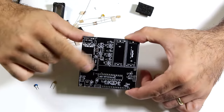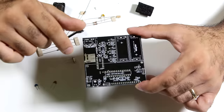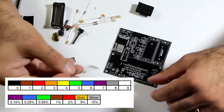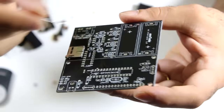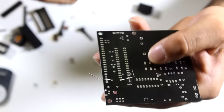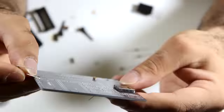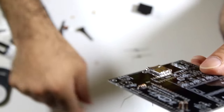Let's assemble the interrupter. One tough surface mount component was already pre-soldered for us — thanks OneTesla. Let's put on the resistors first. The value of resistors is shown by color coding, and the manual shows which colors to expect for each value. I don't solder them one by one — I insert as many as I can, then solder them all in one shot. I insert from one side, bend the legs on the opposite side so they don't fall off, solder, and then cut the legs off. They sent me an extra 1K instead of a 100 ohm — fortunately I have extras.